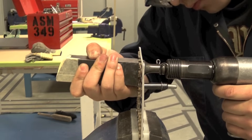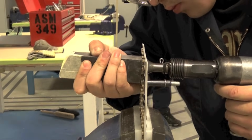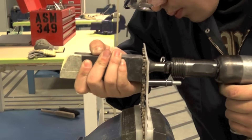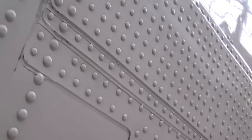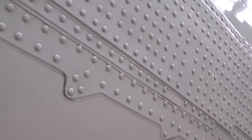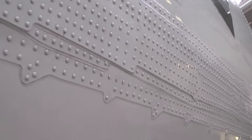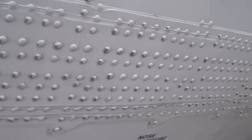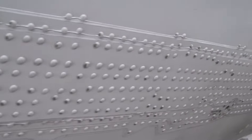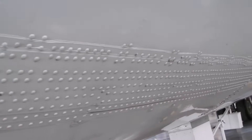Although this method may seem more difficult, it is closer to the real life installation of rivets in an airframe. A third level of difficulty may be encountered when performing riveting on large airframe components — in this situation two people are required, one person performing the rivet gun operation while another uses the bucking bar. This type of riveting is beyond the scope of this podcast but may be the subject of future video clips.